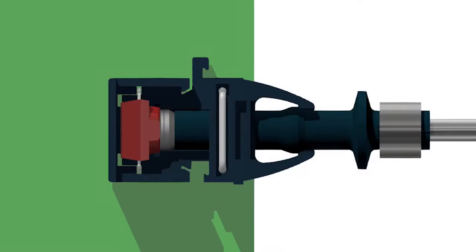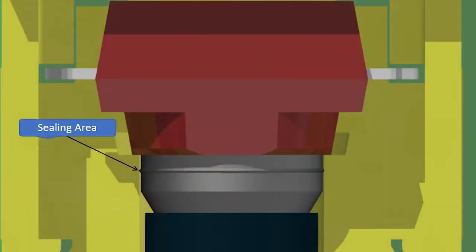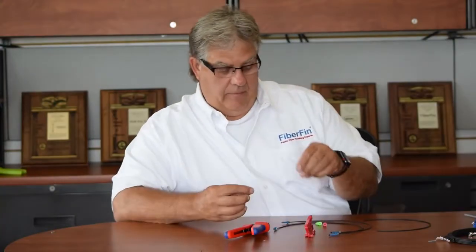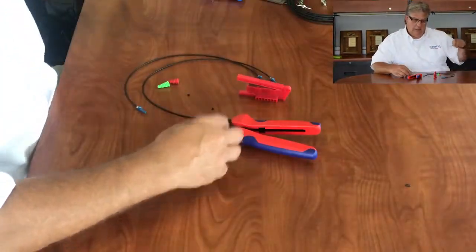It's keeping out moisture, dust, and the likes. It's also very good if you pot your boards, because now you can have a known area around that LED that is not going to have any of the potting solution on it. So let's go ahead and do one of these so you can see what the real background is.